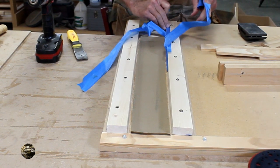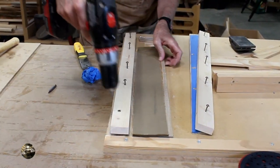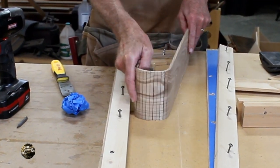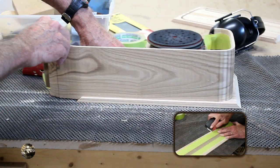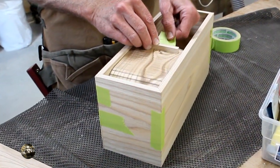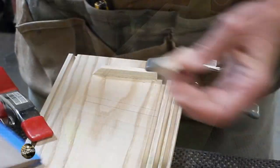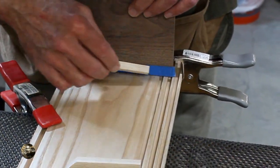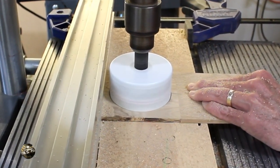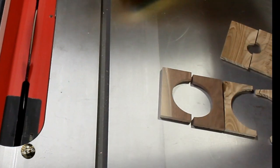This is always the exciting part and makes woodworking worthwhile. I had to do just a minor bit of fine-tuning to make sure I had a nice, smooth, easy glide. I purposely made the cover long, and checking it out here it looks like I'm going to cut off about 12 of the splines. I put some cradles in the box to support the bottle — here I'm putting in the supports for the cradle. I cut the cradles at the drill press and then took the pieces over to the table saw and separated them into the two halves.